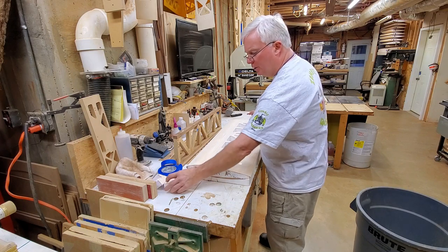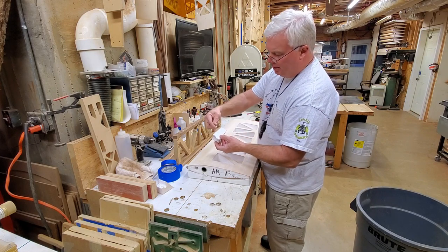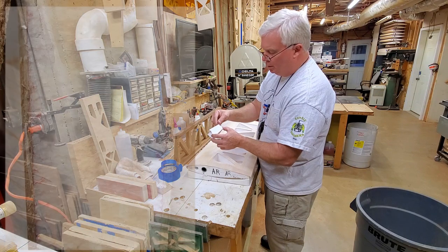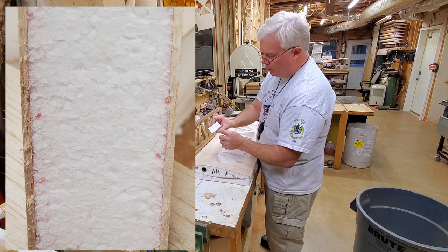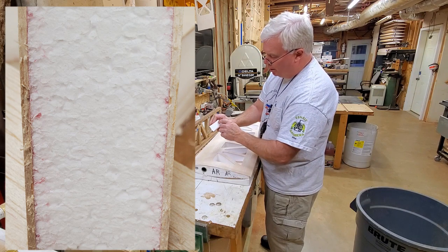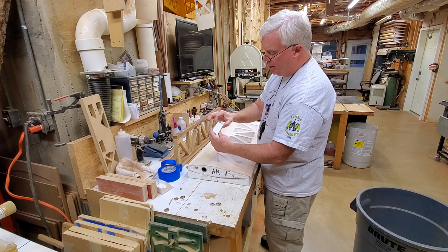And while we're talking about the foam here, and I'll put some still photos in the video, overlay them, you will be able to see the little fingers of epoxy that the vacuum pulls down into the voids between the styrofoam cells. And here's a better side there. You can see that there are probably millions of little fingers coming down, probably a half inch, maybe 5/8 of an inch, just tiny little roots of epoxy. And we can see it because of the red dye that I used.